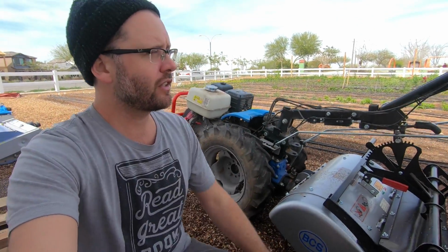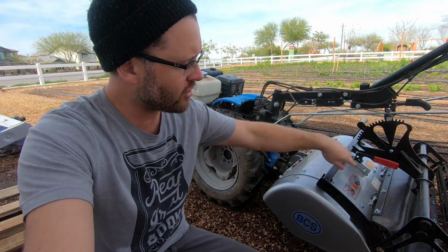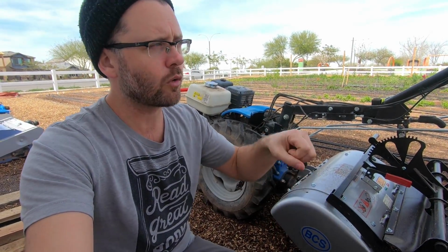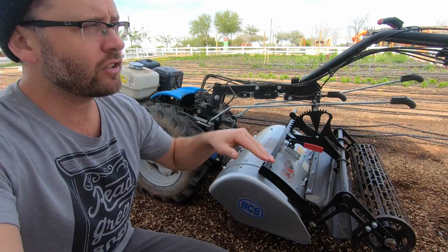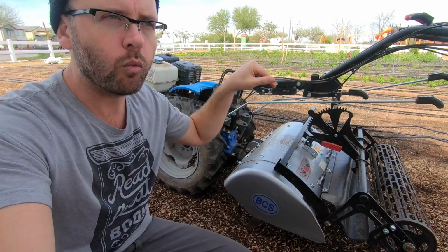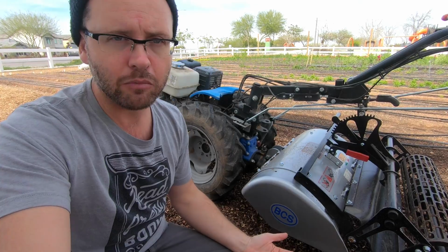The thing that happened with this that I really liked is it made it so that the tiller actually operated better, because a tiller on its own has a steel curtain on the back that is just attached to a hinge point, and it kind of moves freely. So if you're prepping new ground and you're rototilling up a big area, those curtains kind of flop around. If you hit a root in the soil or a rock and your tiller bounces a little bit, you're going to see that little wave in the soil. Whereas with the wheel, you actually get a better finish because the wheel doesn't move around like the steel curtain does. It just keeps it level. And so I found when shaping brand new ground, I get a way better level ground finish with the PDR. And that's something we discovered after the fact. That wasn't something that was initially thought about with the original design. It was just to establish a shallow cultivation.